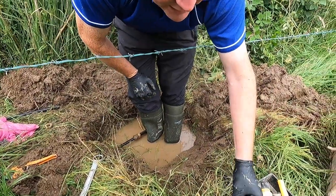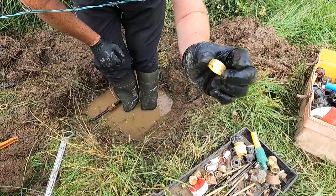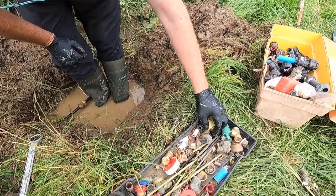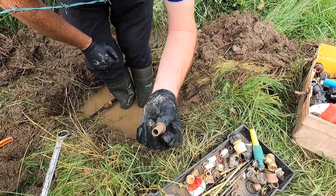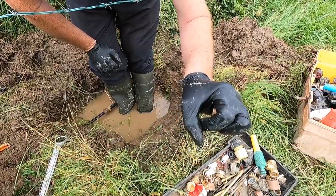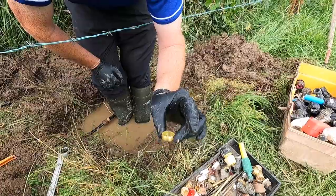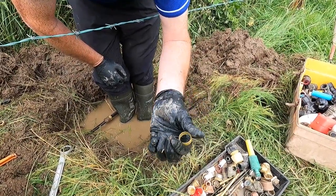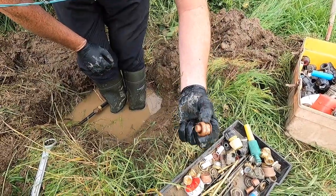With heavy gauge, all you need is one of these rings up into the pipe, and tighten your pipe up into it. Some people do use these little fillers, which is basically the equivalent of these here. You can get them in different shapes and sizes that you can put up into the heavy gauge to stop it from shrinking when you're tightening it, but I've never found one ever leak. They're just so much easier to fix than these, because these are, now they're temperamental, very temperamental.